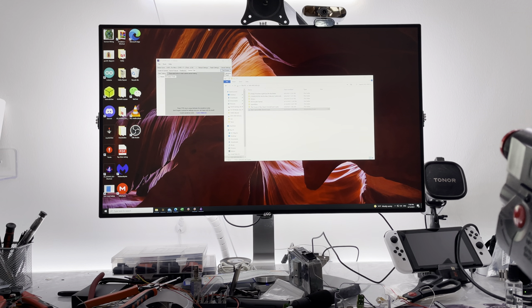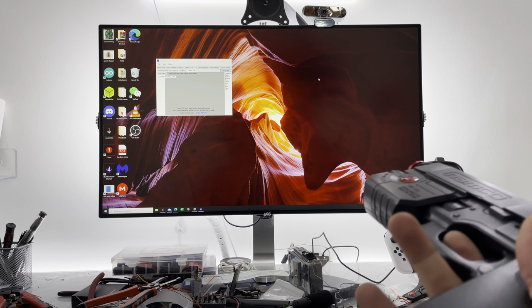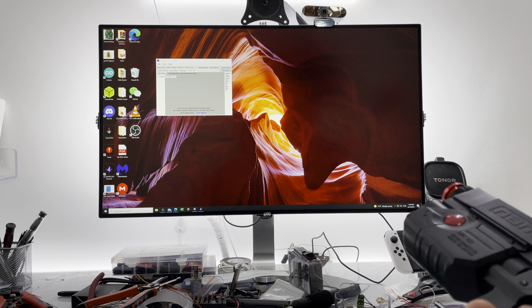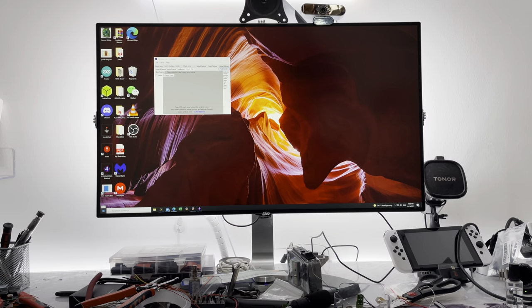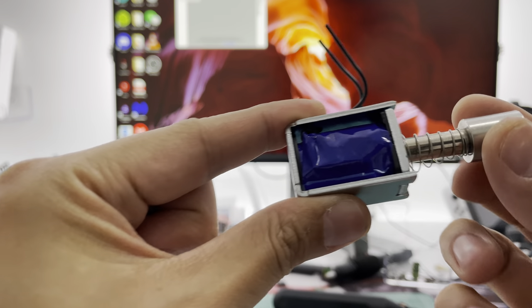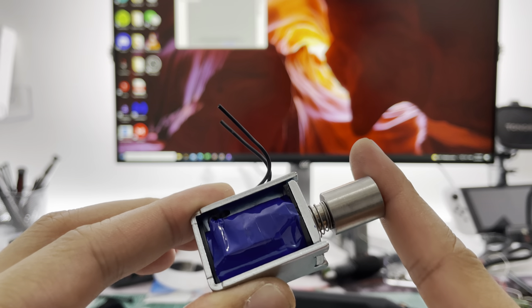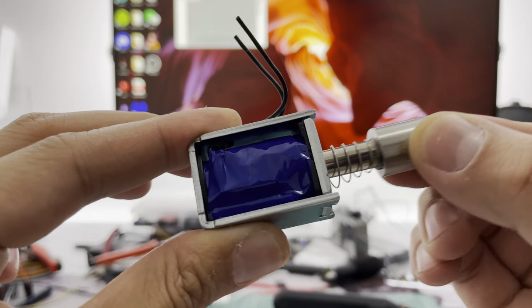That's the recoil — let me close out of my screens so I can shoot a clear screen for you. This is a 12-volt recoil, not a 24-volt, basically because you don't really get much benefit from using a higher voltage — a solenoid doesn't work that way. It doesn't get louder because you put more juice into it. It actually works because a piece of metal hits another piece of metal. This is the AimTrack recoil, and the reason it makes such a loud noise is because this metal is a custom machined bolt which smacks against this, causing that sound, and then it's pulled in and shot out with the spring.